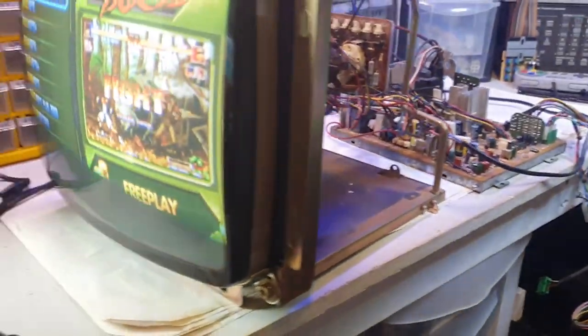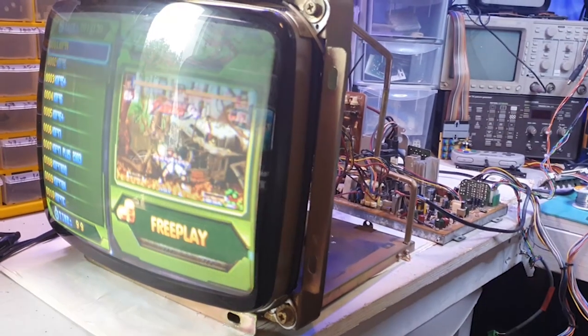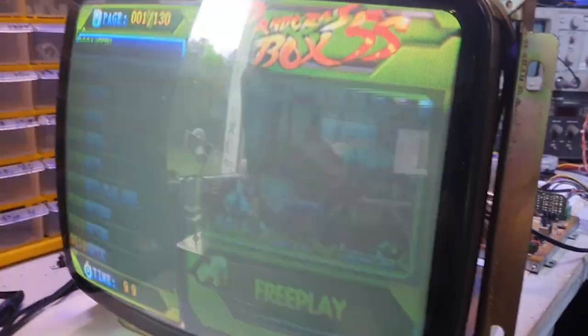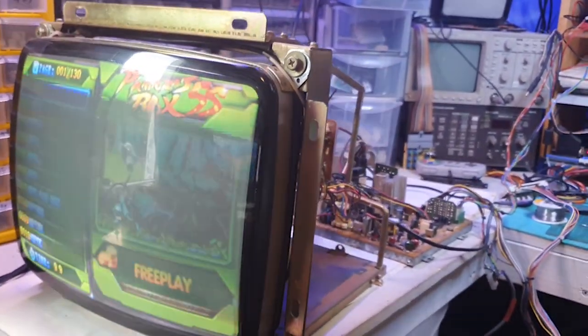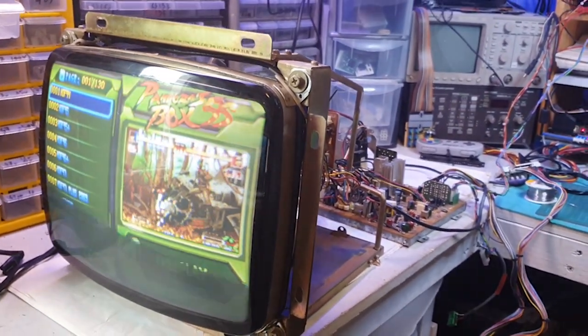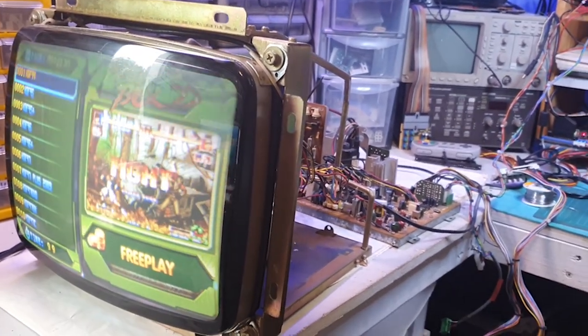I think I'll do that after the video, because right now I just wanted it to start running and to display a somewhat adjusted picture, and I think we did that. So new flyback if I find one, and I'm going to move that transistor to the bigger heatsink.